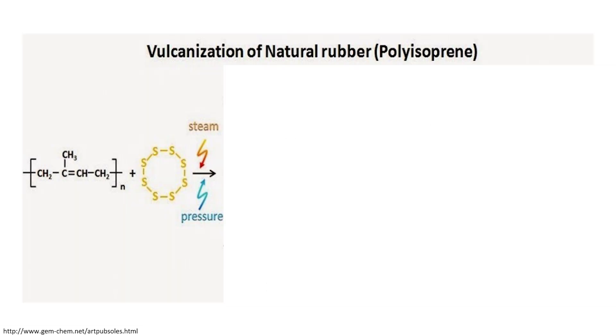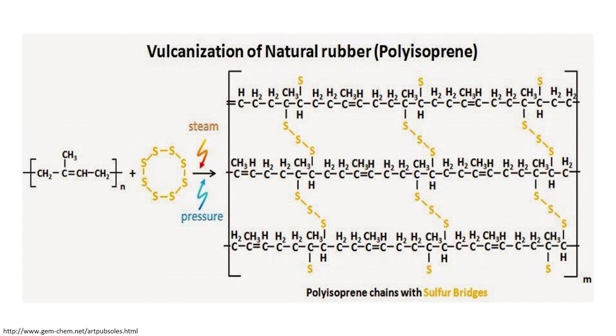The answer comes down to strength. Natural rubber must be vulcanized to make it practical to use. At points where there's a carbon-hydrogen single bond on one chain and a carbon-carbon double bond on an adjacent chain, the double bond is broken and sulfur atoms are added between. These sulfur bridges are weaker than carbon-carbon single bonds but actually contribute greater strength to the polymer as the sulfur bonds can relieve stress by breaking without damaging the overall structure. Links with several sulfur atoms make the rubber more resistant to flexing and less likely to develop cracks. Less vulcanization will make the rubber more sticky but less durable.